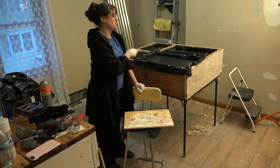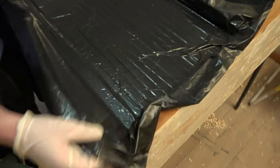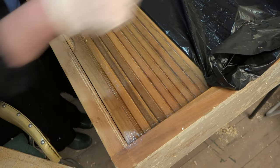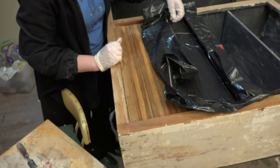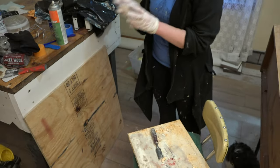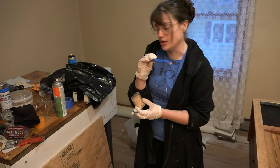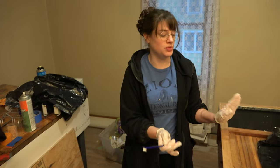What I've got here is one of the many doors to my Hoosier cabinet. So this is just a piece of cut-up garbage bag, and underneath you can see the paint that's just really deep in these cracks here. I really want to get that out, so that's why I covered it in plastic to keep it from drying out. Then I'm gonna use a couple of tools — a toothpick, a toothbrush, and a plastic scraper — and all of my dreams will be complete if I can get the paint out of there.